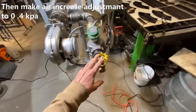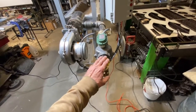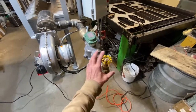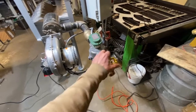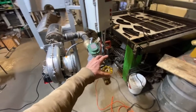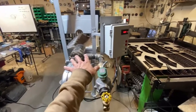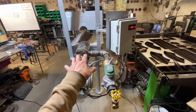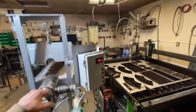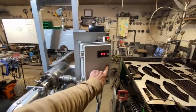In this particular case we have this gate valve that I wanted to try out — that may make it easier for you guys. We would light it a little bit differently with this gate valve; this might allow for a little easier fine tuning and throttle control. But essentially the name of the game is to slowly ramp the fuel up until the burner just lights. You don't want to give it too much fuel or else you're going to get a really big fireball.